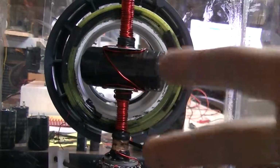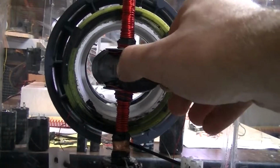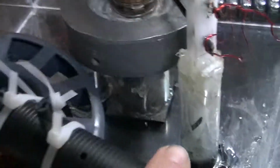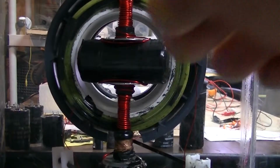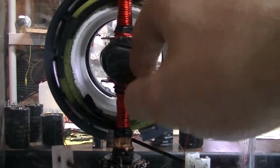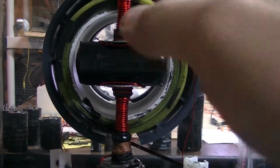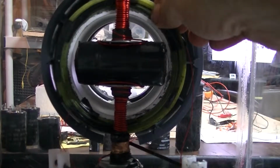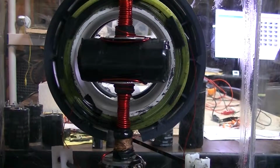Nice. Actually, this entire thing is pretty much recycled material, except for the two most expensive things you could possibly think about putting in a motor, which are these giant N52 magnets and this little piece of pyrolytic graphite down at the bottom. Basically, this is a 1 1/4 inch diameter, I believe, and then it's a 3/4 thickness. And then I set up this coil by taking pieces of plastic and using some scissors and just cutting 1/8 inch strips and wrapping it around as guides.